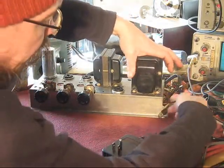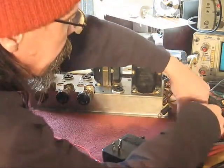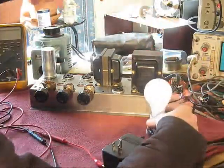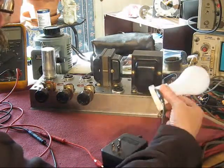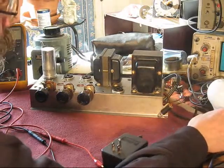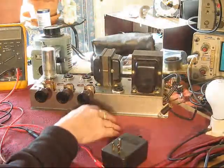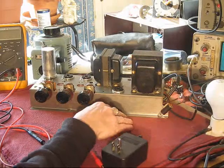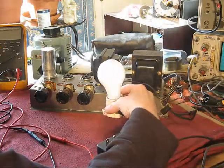It's a pilot light. And the 2 pigtails, I'm going to attach them to this 60-watt bulb just as a ballast for initial checkout. So with these 2 disconnected, I plug it in, give it full 120 volts. It's not going to do anything. And so all the current into this has to flow through this.